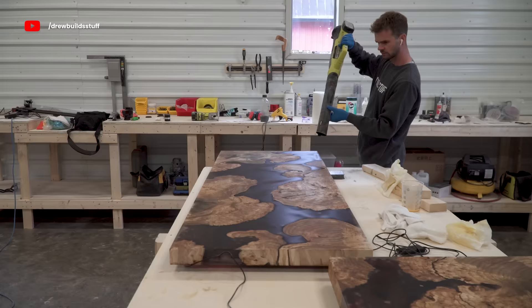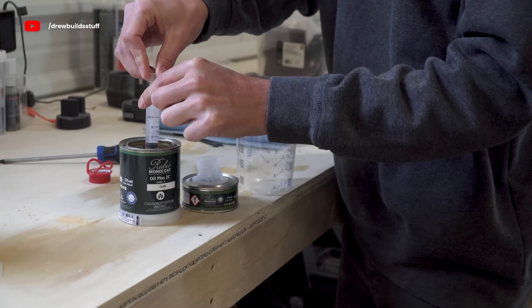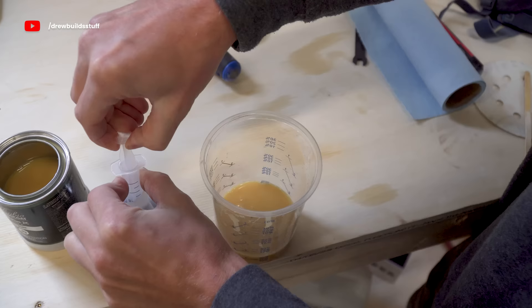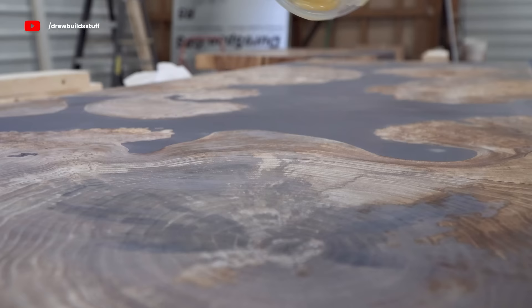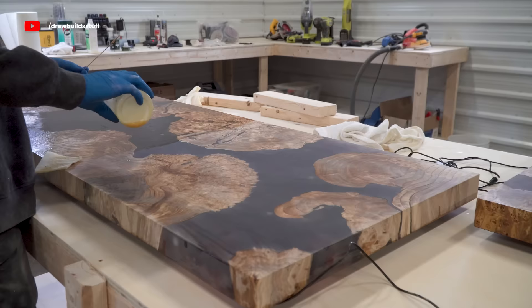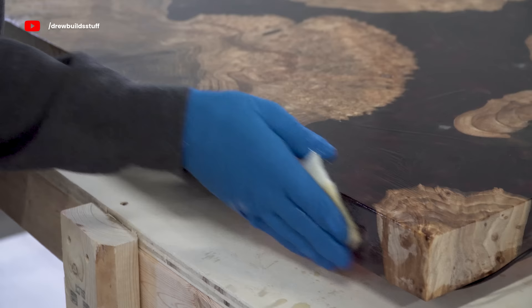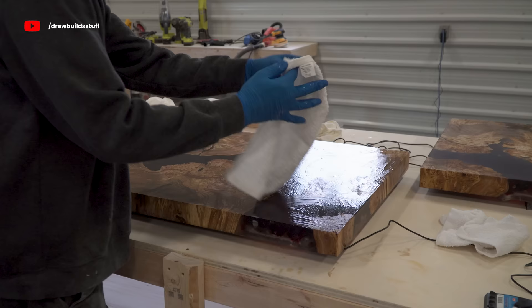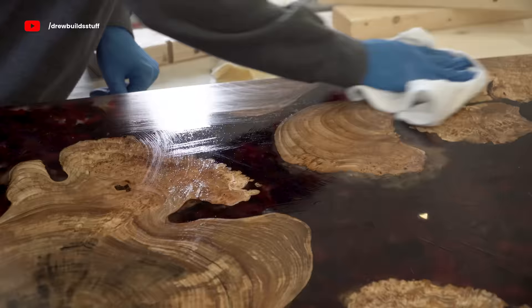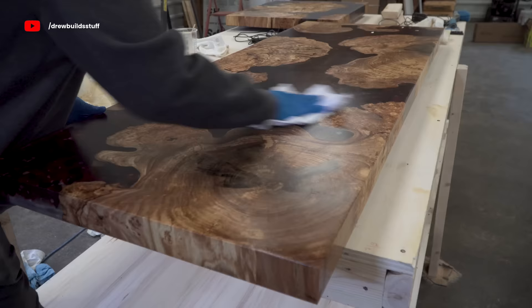I was considering doing an epoxy top coat but to be honest this piece is for me and I'm not a huge fan of the super-glossy epoxy look, so I'm going to use a finish I use a lot called Rubio Mono Coat. It's really easy to use — you just mix the two parts together at a 3-to-1 ratio, then drizzle some over top of the tabletop and use a white applicator pad to work it into every square inch of the piece. Then I let that sit for a minute or two and come back with a terry towel and try to wipe off as much of the finish as possible. That takes some elbow grease and quite a few terry towels, but the ultimate goal is to have none of the Rubio left on the surface, and that'll leave you with a really nice protected, kind of medium-sheen finish.